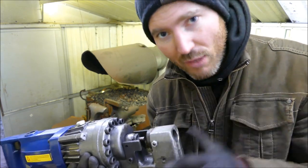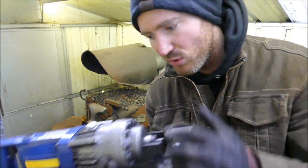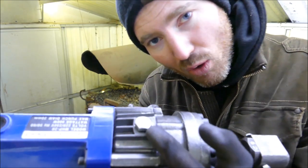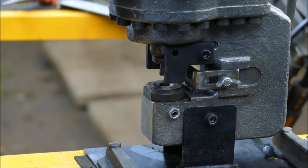It's really worth noting early on — if you get one of these and it's suddenly not going through, it's probably because there's an air lock. All you have to do is undo this bolt and add a bit more oil and let it circulate through. I've been using compressor oil, which is the same as hydraulic oil. To date I've punched over 600 holes with it.